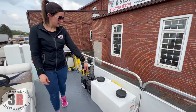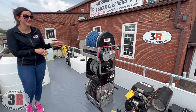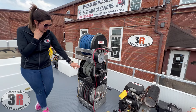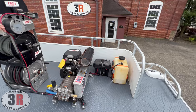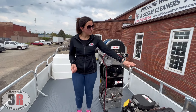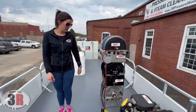The tanks provided were seven gallon and 16 gallon. Up top we have our soft wash hose, our pressure washer hose, and at the bottom the inlet hose. Then we have our eight gallon per minute pressure washer with a Honda engine. We have the muffler pointing outwards with a rain cap on it, so sitting out at a dock it's not going to get water in the exhaust system and it's not going to point onto another boat or onto the dock while people are walking by. We definitely wanted to make sure that exhaust is going in the right direction. The fuel tank is just strapped right up there to feed into that system.